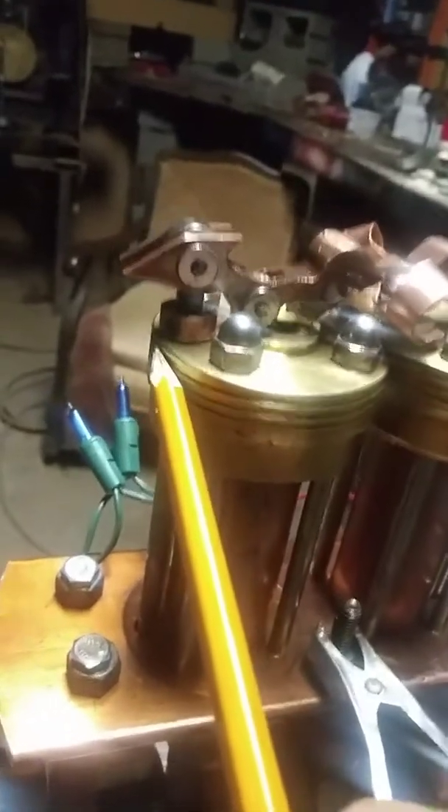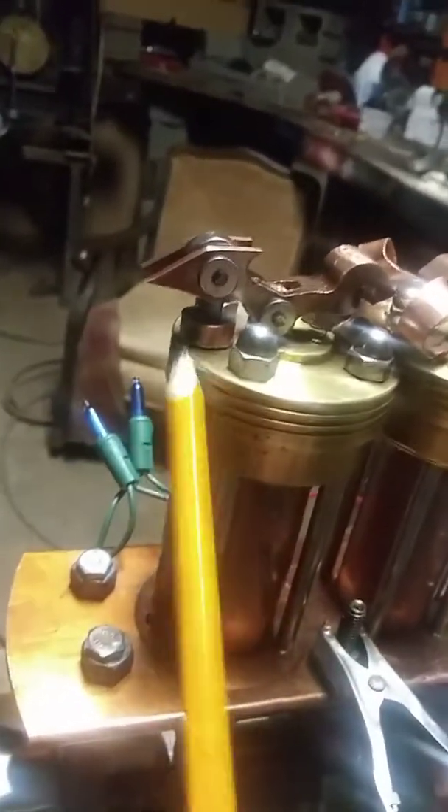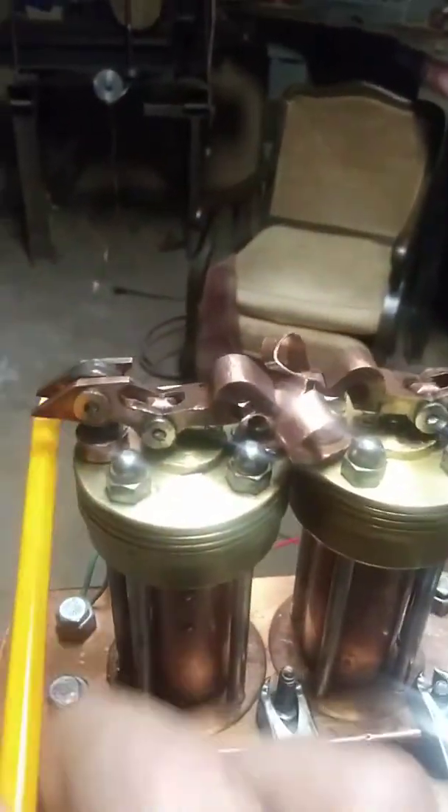I know there are a thousand more efficient ways to make the switch on the solenoid work, but I like push rods and rockers. So these solenoids switch on and off via this eccentric — this eccentric is a roller bearing — and it pushes up on the push rod going all the way up through. The push rod is in a bearing up here. This is a brass head. It comes up and works the rocker.